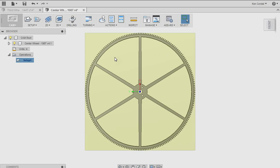Now, one way to do that would be, before I start this operation, to drill and tap holes, and you'd have to put at least two in each waste piece so that the waste piece didn't shift. And that's a lot of time, because my machine can't do tapping, so I could drill the holes, but then I would have to hand tap them and put two screws in each one and so forth. Now, I will probably use that technique when I work on the really large 8.5-inch diameter gear.